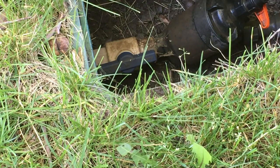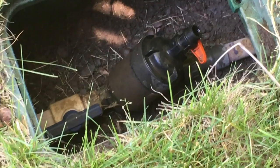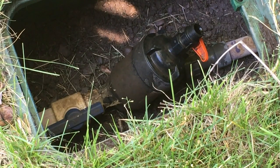Now I can go back on to my next sprinkler project. Slightly cleaner water, but I'd like you to think about that. As dirty as that was, I was still getting brown water out of the pipes last week. This only does so much good. All that gunk, all that dirt is likely to plug up a regular sprinkler. It'll definitely plug up a drip, and since I'm doing drip, that's why I got the extra filter. I've got to increase my chances of making sure everything's efficient, that everything doesn't get plugged up.